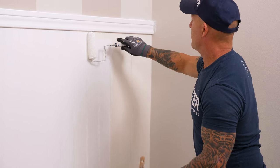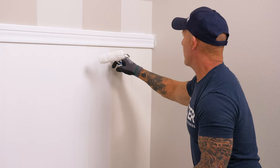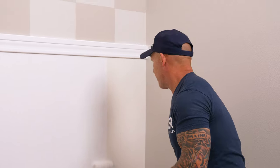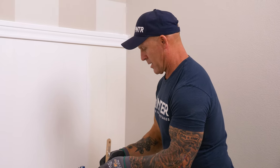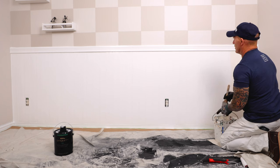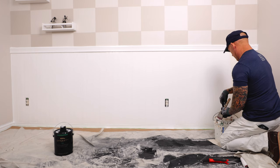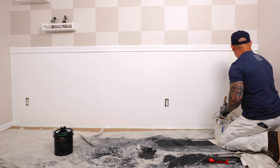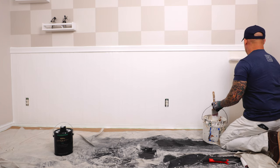When I'm putting the paint on with my roller I don't want to go too far ahead — I'm only doing a couple of four-inch beads at a time. For a pure white it's covering incredibly well. Usually whites without any tint in them don't cover well at all and definitely need two coats.